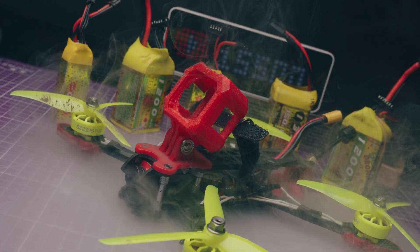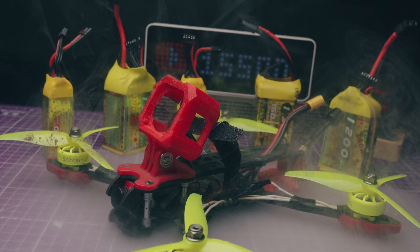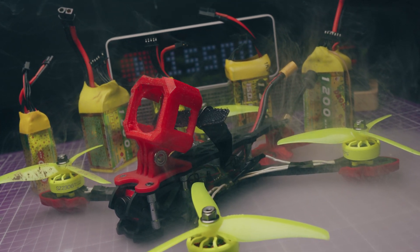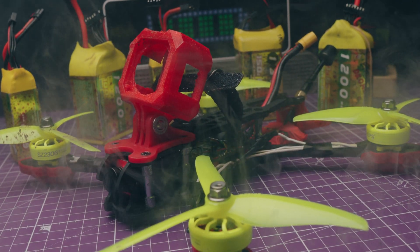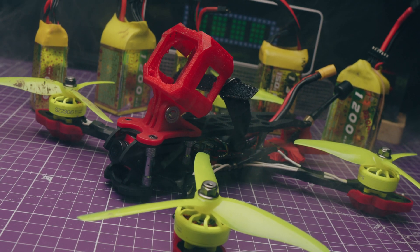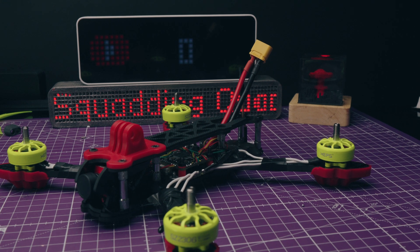I think the frame thickness discrepancy on one side is a potential cause of why the fire happened. The other question I'd raise - and I'm not pointing fingers - is whether an ESC and flight controller combo so cheap could be that the ESC isn't quite rated as high as claimed. I'm just trying to consider how we move forward. I'd probably recommend spending a little bit extra - we had about $10 to spare under our $100 goal - so I think I probably could have bought a slightly better-named ESC.